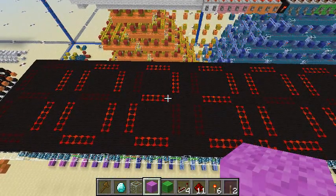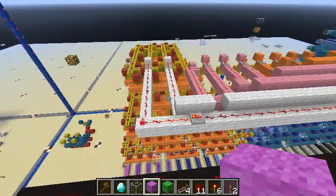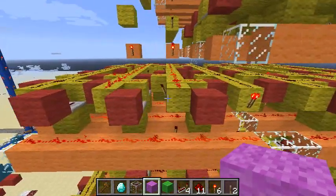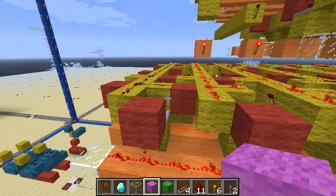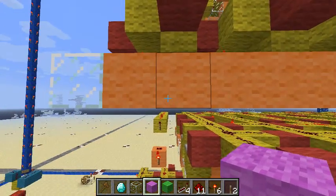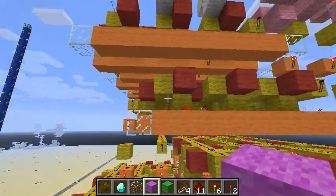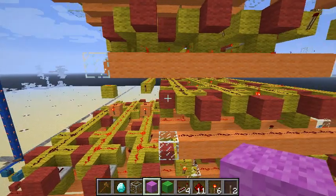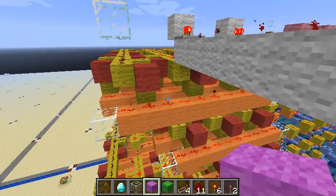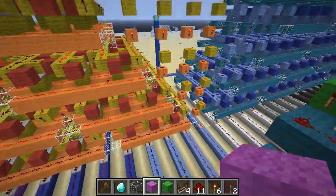And so this is a nice handy little device — well, it's not all that little. The meat of it, the stuff that actually performs the algorithm, is just these stacks over here. It's just a repeating unit which takes four bits of input and then selects from nine different lines to give you a four-bit output. The fact that they're slanted to the side like this is critical, because the largest bits have to be processed through the algorithm many, many steps, whereas the smallest bits need to only get processed through the algorithm in a few steps.